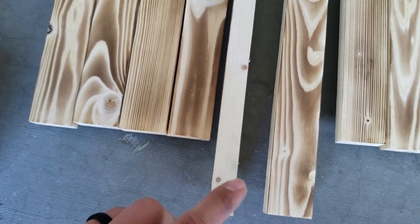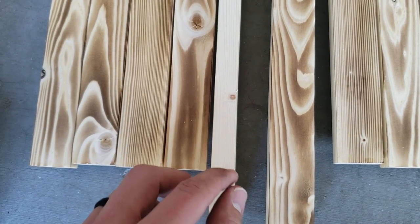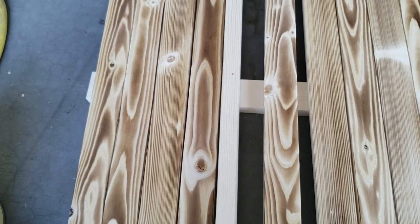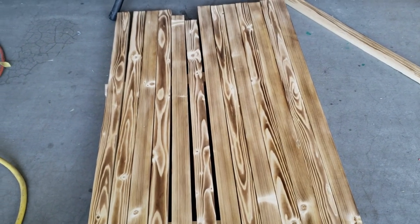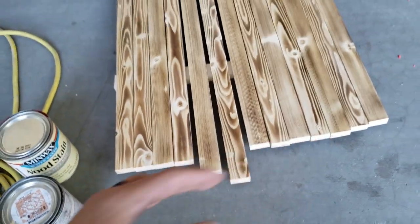When you're staining, you also want to stain just inside these edges with the black, just so that no white shows through in case they don't sit perfectly flush. I'll leave the very bottom and the very top unstained, just so that at the end I can sand it, and then burn it, and then it will be a nice, clean, consistent border all the way around.